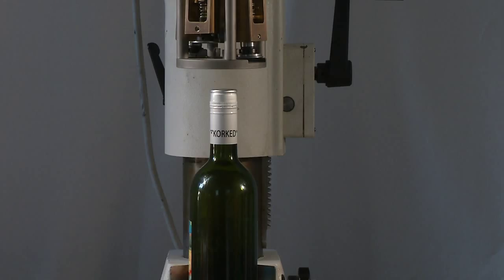Second verification: check that the glass finish on the bottle is at the proper height, constant, and has a constant thickness. Moreover, verify that the diameter of the next bottle is suitable.